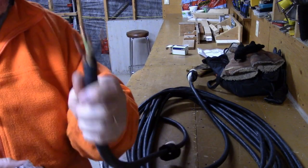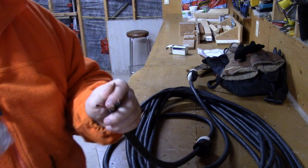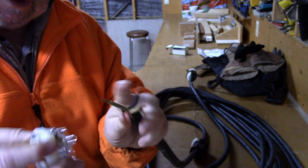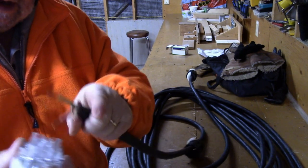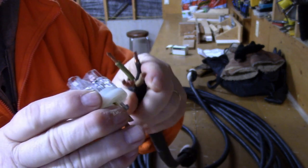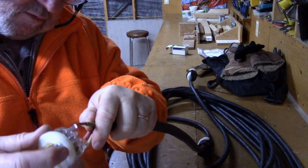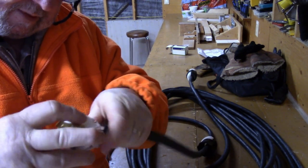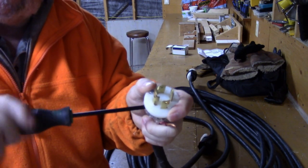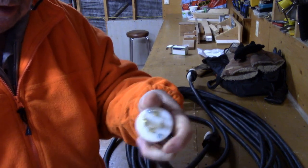This is just your own personal preference, but I like to put the ground wire in first. Now that I have the ground wire skinned and twisted up good, I just insert it up this little collar right here, and that collar will direct it right into the screw terminal. We take our green Robertson and we tighten that up. You don't have to make it insanely tight, but it has to be good and tight.